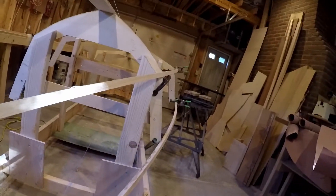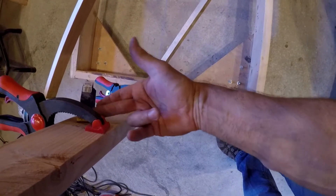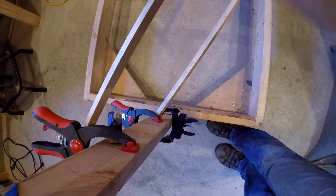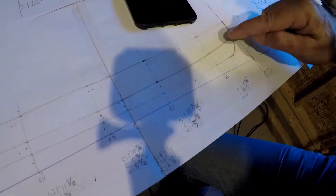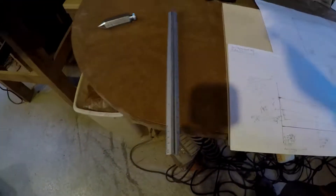I think that's what I'm going to go for and it won't hurt any of the rest of the lines as far as I can tell. I'm going to eyeball where that intersection point at the chine would be at the height we want it, to maintain a parallel angle across, calculate how far back, and work out what the shape of the stem needs to be from there. Brought the chine intersection point back to get a little more continuous angle in.